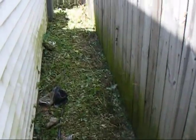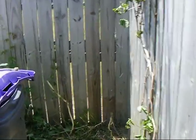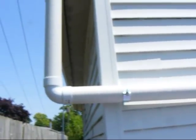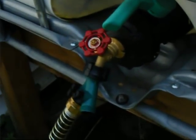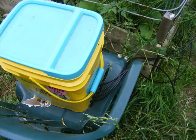I'm going to walk back behind the garage and let you see the rainwater system. What I did was repurpose an IBC tote that I purchased — a 275-gallon tank — plumbed up to the gutters on my garage roof. If I get about an inch and a quarter worth of rainfall, it completely fills that tank. There's some algae in the tank; next year I'll paint it black so that sunlight doesn't get in as much. The valve is simply a hose bib with a Y fitting, which helps flush sediment out of the bottom of the tank.